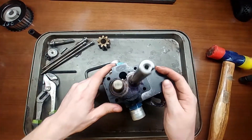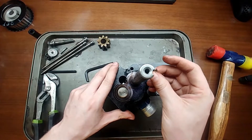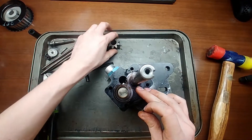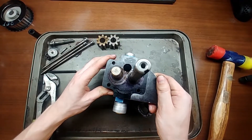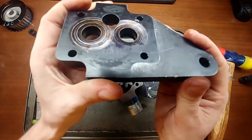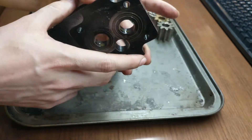The woodruff key is what actually transmits torque from your pulley down to your gear, makes your other gear spin, creates vacuum, and creates a pumping motion. With that off you need to get the woodruff key out — light pressure usually makes it pop out; there's nothing retaining it besides being sandwiched between the two keyways. Now you take off this little divider plate. There are o-rings in these divider plates to make sure no oil can pass through, since the different stages need to seal independently. They're very small and hard to see.